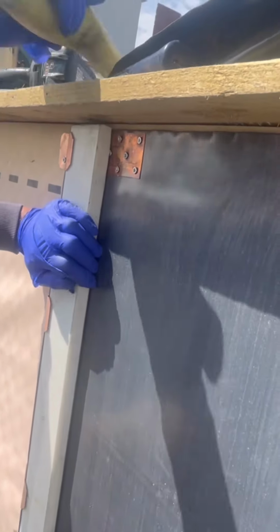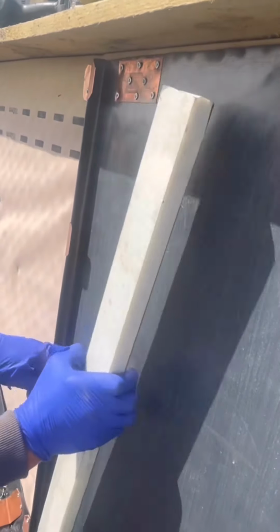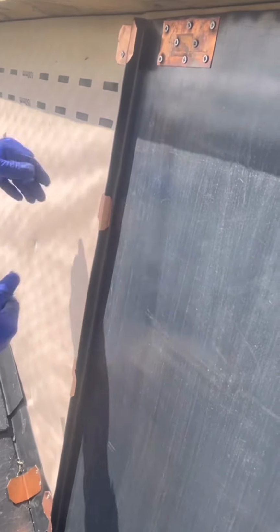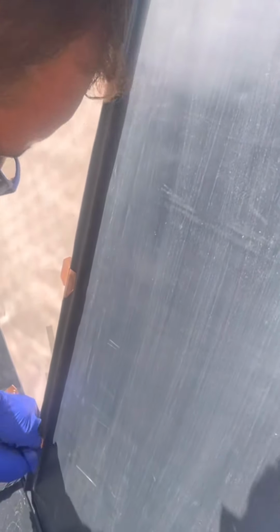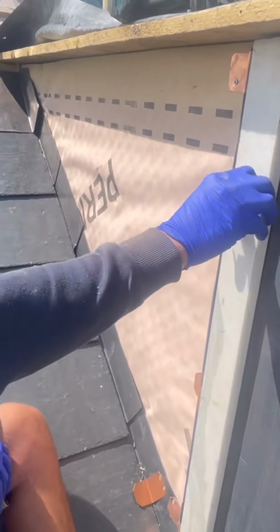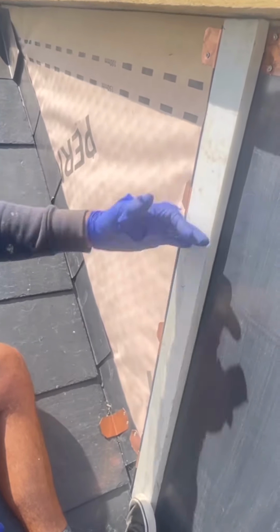The second one we're going to put on in a moment, which you will see, has got a slightly bigger welt. So you can probably imagine already, it's twice the size of this welt. We butt it up this side with the extra clips on the bottom, no clips on the side to start with because the clips are hidden in here. Put our first welt in, put the clips down that side, the same process, use something heavy, level, batten, or like I say, we've found a piece of marble to dress our next welt round, which we'll show you in a moment.